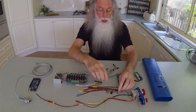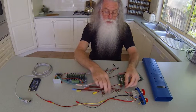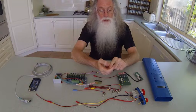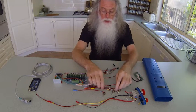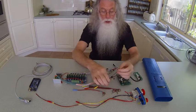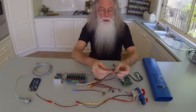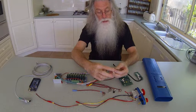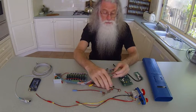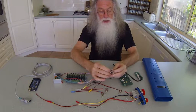In the center section, I'm having a row of buttons, switches. There is either the lever type or the push button type. Now, if you measure your finger, it's roughly 20 millimeters wide. So to fit 7 switches in such a small space, they will be one lever, one push button, one lever, and as long as the gap between the two levers is 20 millimeters, you can easily press the button. The other benefit of that is you cannot accidentally knock the button, because the levers stop it.